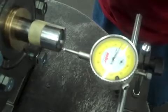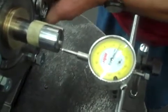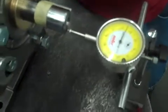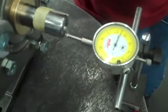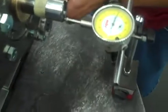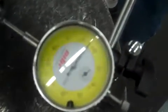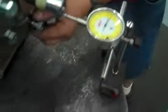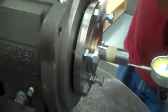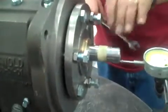The end of a bolt is not a real flat surface. Once you get those a little tighter, and we go back again, get them to 15 thousandths. We're at 15 thousandths. That's our setting. Now we have these locking bolts that we put on. That holds everything in place. Just like that, 15 thousandths. That should spin.